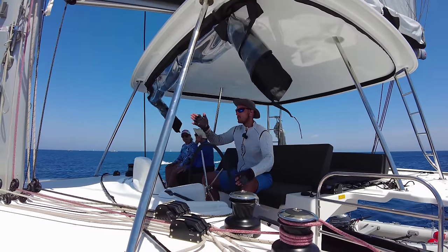You don't want to overdo it, but if it's too loose, and you get a lot of wind, everything stretches. If you get a line like this on the sail, you will deform the sail. You can tension this while sailing, but only by depowering the sail. When you're sailing at full power, don't pull this, because it's going to be too much pressure. But you can open the sail, depower, and then pull this up. So this was pretty good. The mainsheet is now on the winch.